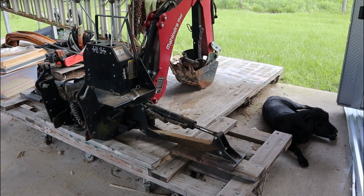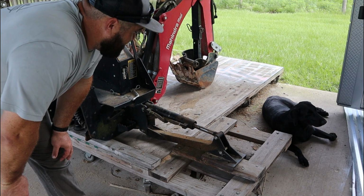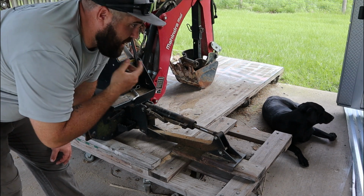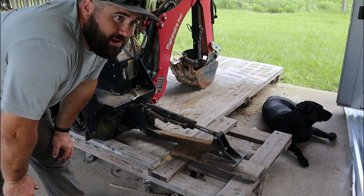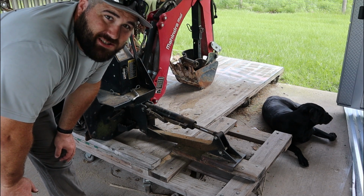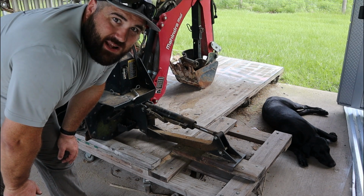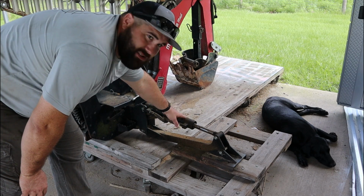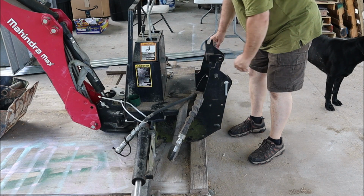And then when we want to put it on, we just back up the tractor to it. But see, one of the issues that we have is this is Papa, the actual Papa, my Papa, and LaLa Papa, and me, we all built this, and it was a really cool thought, and it's executed really well, as long as the backhoe's only sitting here for, I'd say, 3 or 4 days. But everybody knows that hydraulics will slowly leak, and that's what happens every single time we set this here: over a period of time, the backhoe likes to sit down on us.